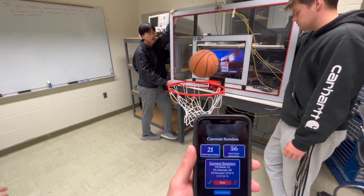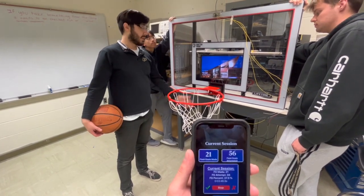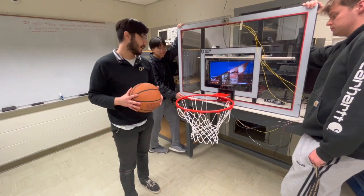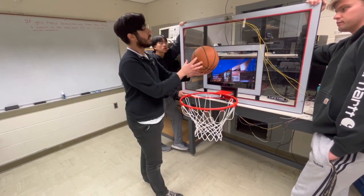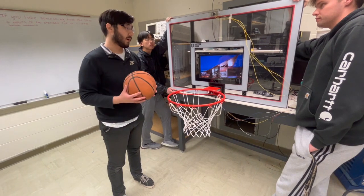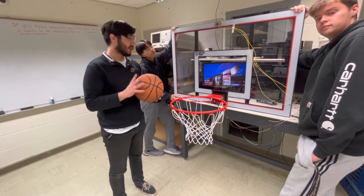As you can see it works but is slightly finicky. We could try to use a better distance sensor on the bottom, but we accidentally burned it and these HCSR04s are all we have left — they're a bit inconsistent, which we also saw during the midterm demo. We've tried different sleep values to improve results, but it still gives imperfect outputs. With better sensors, more time, or additional sensors on the rim like an accelerometer, we could have gotten better results. We put a lot into ultrasonic sensors and unfortunately they don't work the best. Thank you for watching our video — we hope you enjoyed our demonstration.